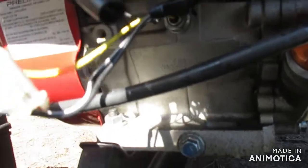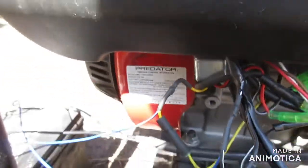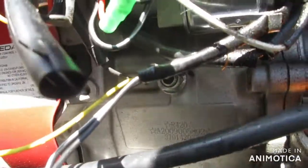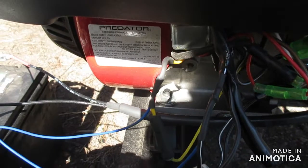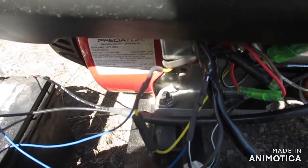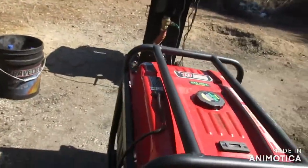This yellow wire goes to the low oil pressure sensor of the engine. Most modern generators have that — it's always right there on the side of the engine. I simply spliced into that, and that's connected to the coil ground. When your engine is low on oil it triggers that, closes that circuit, and grounds the coil out — the engine stops. Same concept with ours: we're closing the ground with the relay.